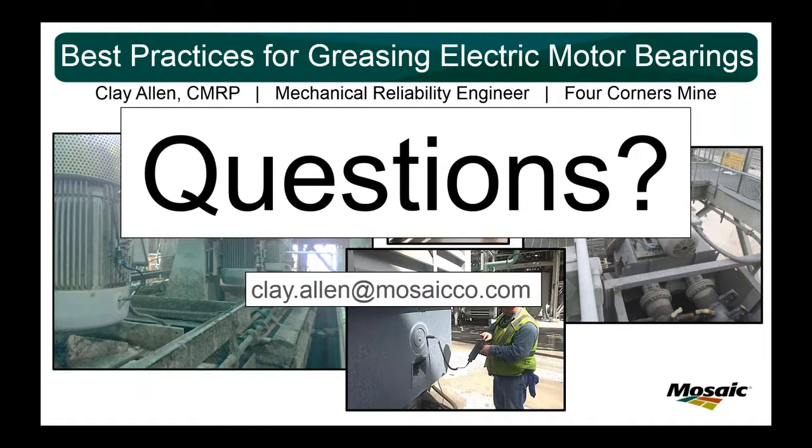All right, awesome. You mentioned the software, so someone was asking, when you were showing your reports, for all the zeros on your actual strokes column, how often did you check those bearings to ensure the lubrication was holding up, or is that even something you recommend? Every 3 months, that's the data. If I walk up to a motor and I stick the sensor on, if it sounds good, I'm going to press the before button, and if it sounds good, I'm going to press the after button, save it again. And that's how you get the zero strokes into your software.